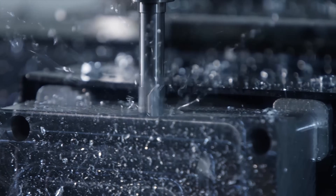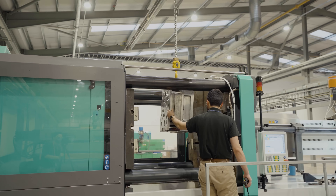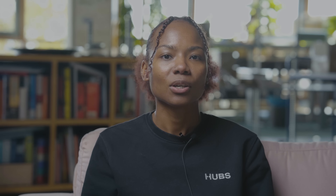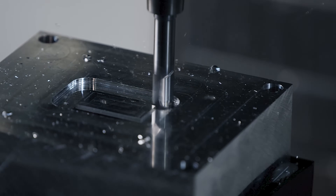The main economic restriction is the high initial cost for tooling. Design engineers have to create a custom mold for each geometry, making the initial investment costs pretty expensive. To design and manufacture the mold costs between $5,000 and $100,000. For this reason, injection molding is economically viable for production larger than 500 units.